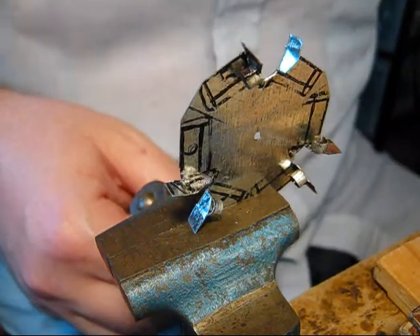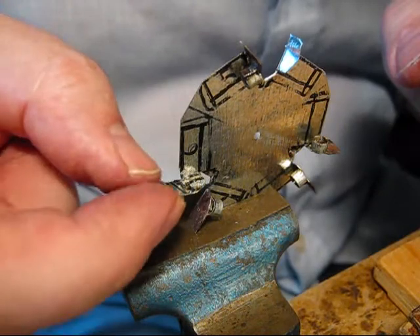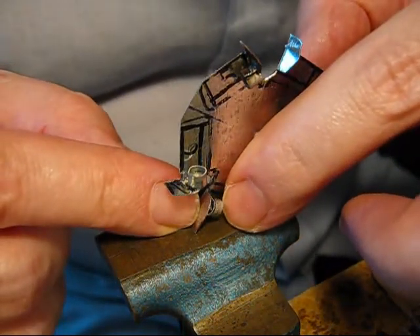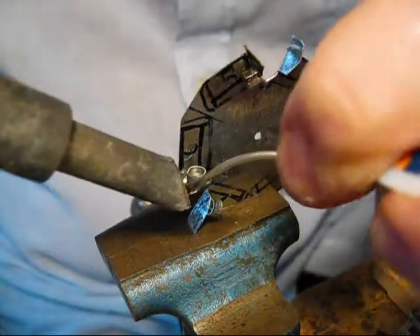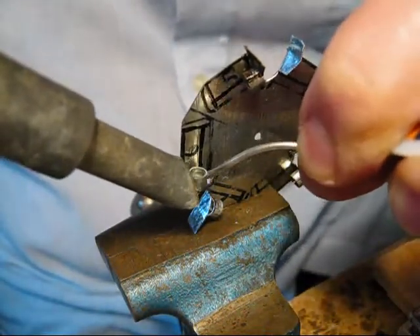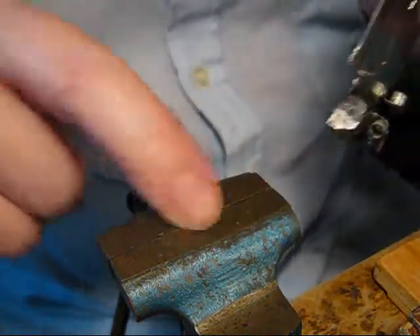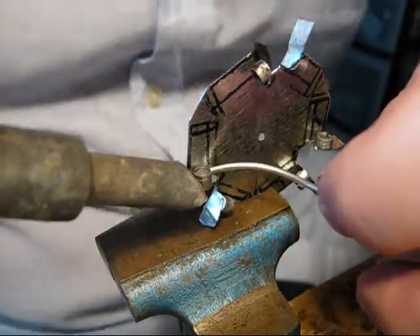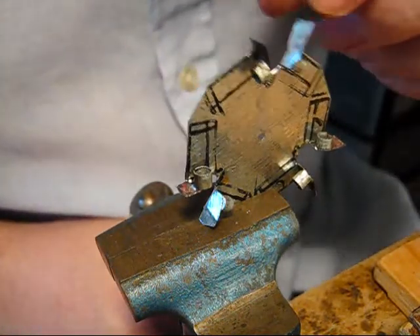The reason I'm doing it this way is that this flap is too far away from this lap, so when I solder this part, this one will never desolder because there's too much distance between them, and the whole plate doesn't get hot — because that's the heat sink. Oh wow, I'm done.